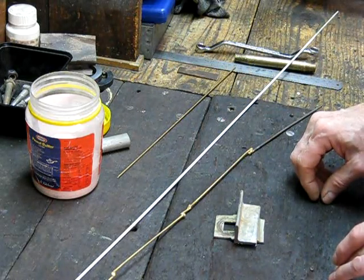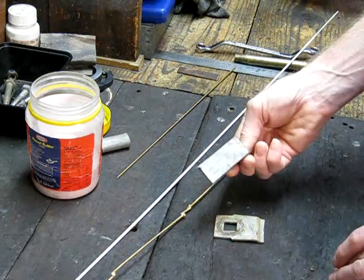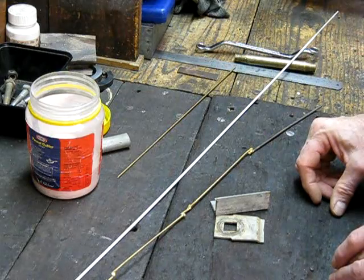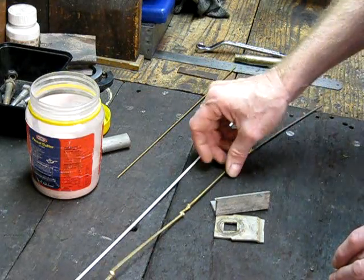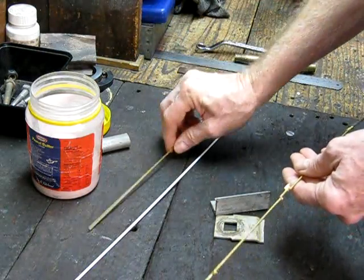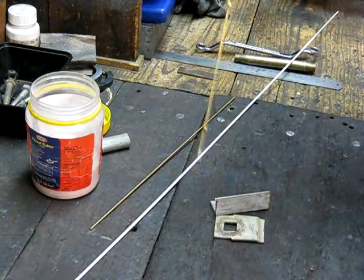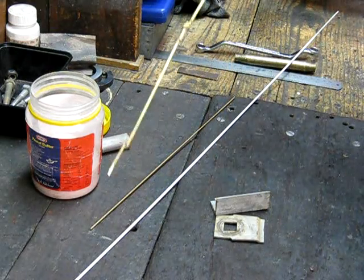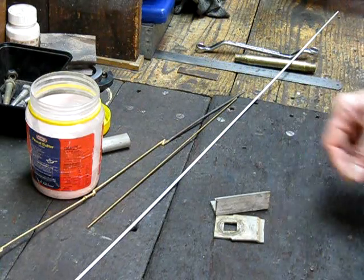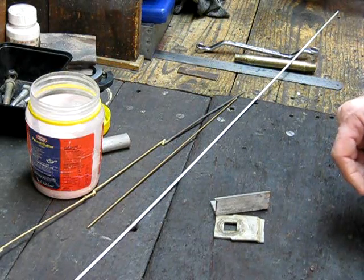Bronzing is very easy and it will do thick to thin — even very thin material. I've had to repair a power steering pump housing which was very thin metal, almost like sheet material, and it did a beautiful job. Another trick with plain bronze rods: as they get really short, you can just join them together — melt them together and you've got a full rod length. That way you can use the old scrappy bits and get your full money's worth out of your rods. I hope that helps — any more questions, ping them in. See you next time.